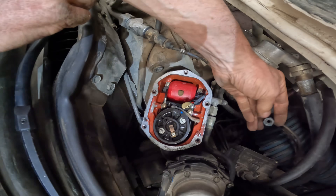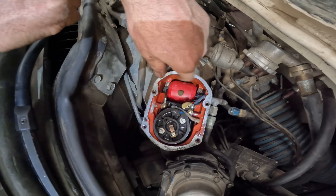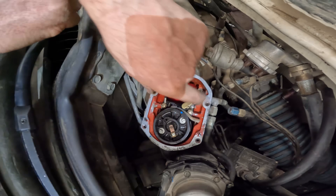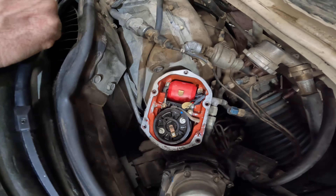This pipe provides a little bit of suction back from the throttle body so that it creates a bit of ventilation of the magneto, which helps dry it out if it happens to get moisture or condensation inside.